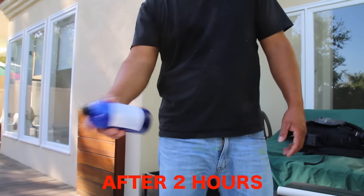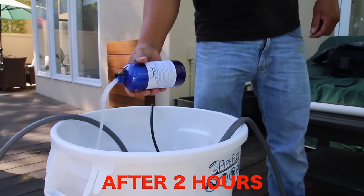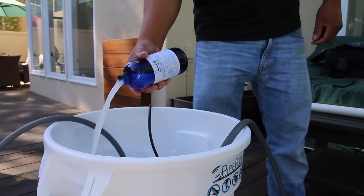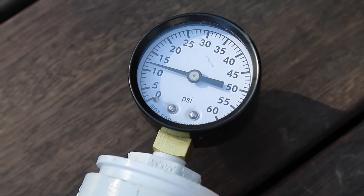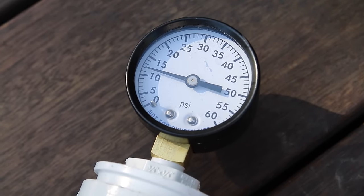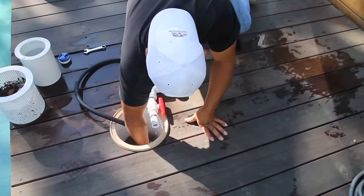After a couple of hours, we shake up Part B and — without interrupting the pump — pour Part B into the loop, allowing it to run for about two to three hours. After it runs for two to three hours, we shut our sides of the rig and do a pressure test. If you watch this pressure test, you'll see that it's holding.